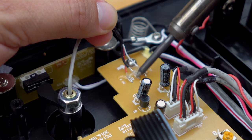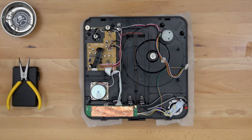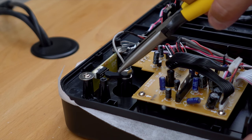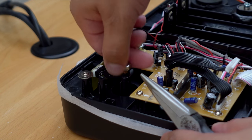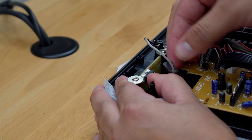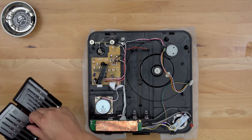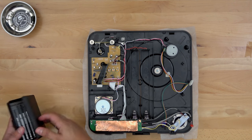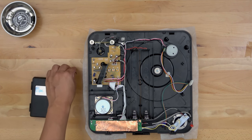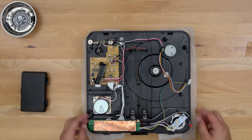Now that we have it opened up, I'm going to desolder the original tonearm wires off this board by heating up the existing solder — you can see we have a clean break right off the board. Next, with our needle nose pliers we're going to take the nut off the bottom of the original tonearm. Once it's loose enough you can just unscrew it. Then we need to carefully remove the switch lever — the easiest way is to slowly unscrew it. After that we need to pop off the e-clip using a small flathead screwdriver.